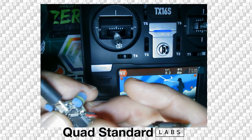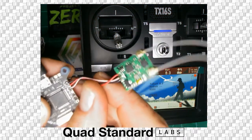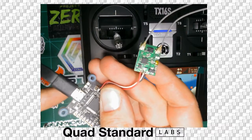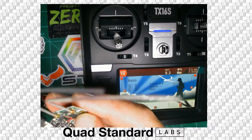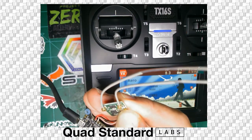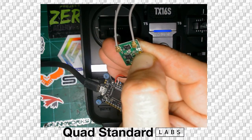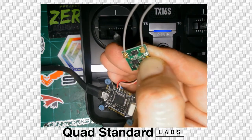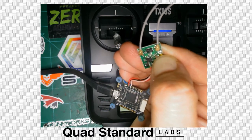This power rail is going to allow us to power the receiver up on USB. We're going to show you first how to bind it to your RadioMaster. We're going to connect the USB to the flight controller, but not to the computer yet. We're going to first hold the bind button, and then plug in the USB. If your receiver is not powered by the flight controller's five-volt rail, you'll need to plug a battery into your drone while holding the button. This is the easiest methodology for a receiver powered by the flight controller.